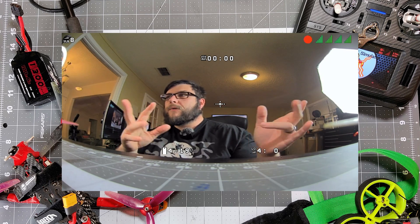Turn off your fan, disconnect the VRX from the VTX, and make sure you store your firmware update cable by HD Zero in a safe place. They're making firmware all the time, and you will be flashing this thing pretty often if you want to keep up with features — you do not want to lose that cable. You can buy a replacement from HD Zero, but it's much easier if you just keep the one you have in a safe place. Now power up the system to make sure we get a video signal from our VTX to the VRX. Power up your VRX module first, then plug a battery into the quad. We should see video come up in our scan on the VRX — and there we go, we have video from the drone.